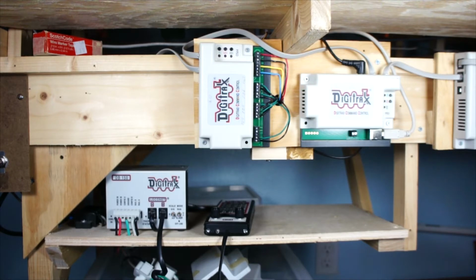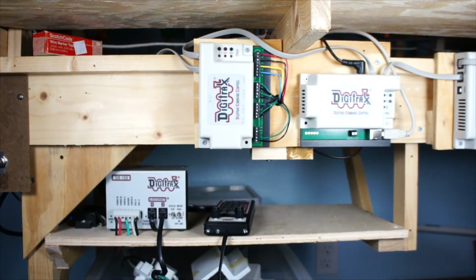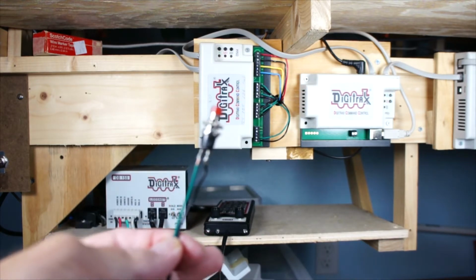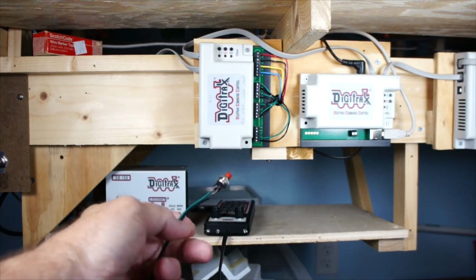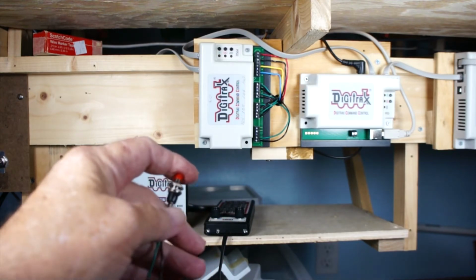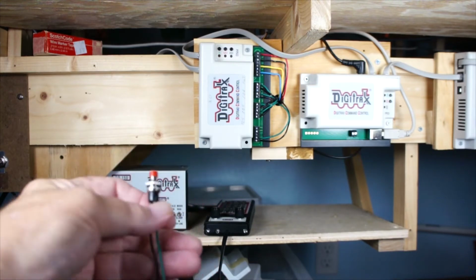I don't know if you could see them here. I don't have any in the screenshot, but they're the Tortoise slow motion switch machines. The 4 wires up on top right here are for manual control of the switches. What I did was put some pigtails on this switch right here. It's a normally open push button, and it closes the contacts whenever I push it down.